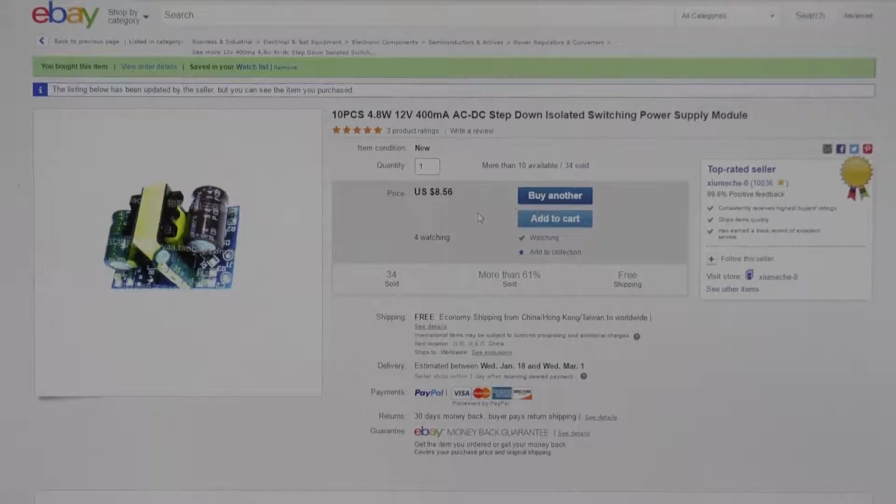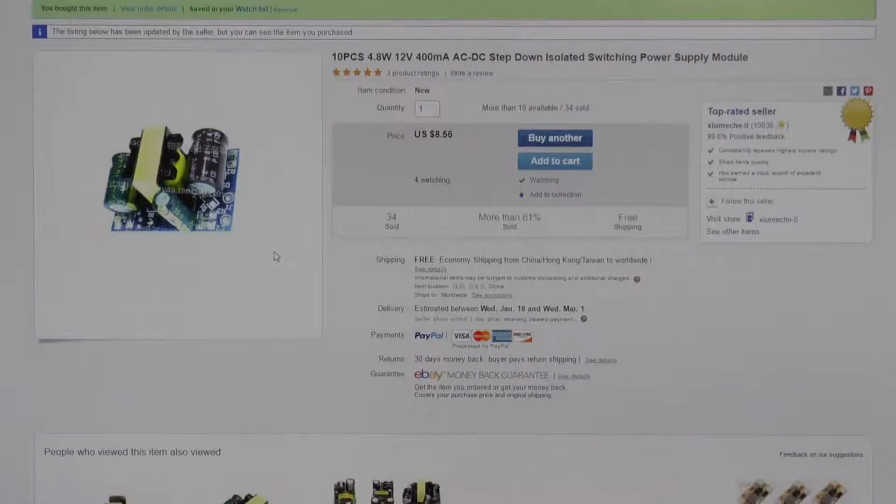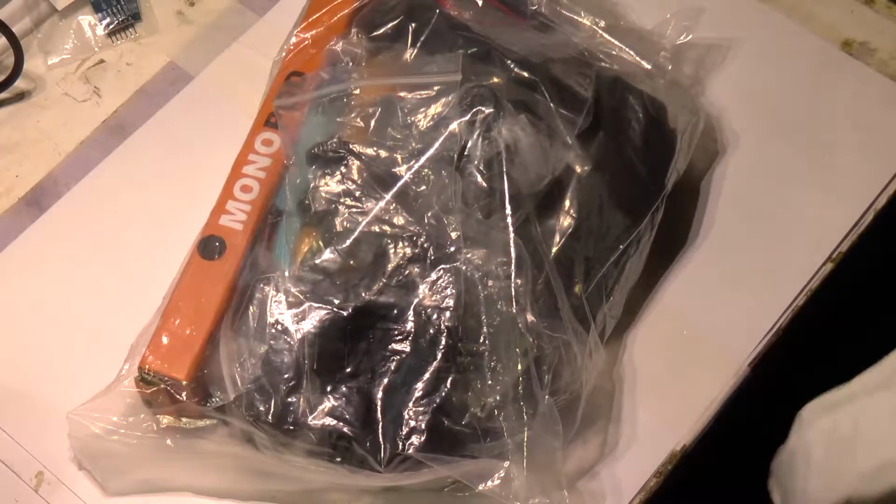And these 12 volt modules. So you saw that I tested and it works fine. Even 30 volt DC, but then the output load cannot be 400 milliamps, but it works. And here are voltage dividers and I can change that divider, so this thinks that the voltage is lower and raises up the voltage, so I can change whatever voltage I want up to 18 volts. Whoa.